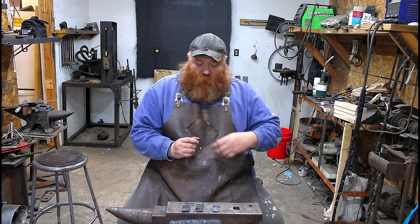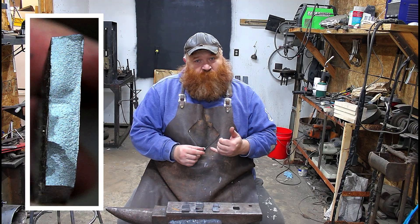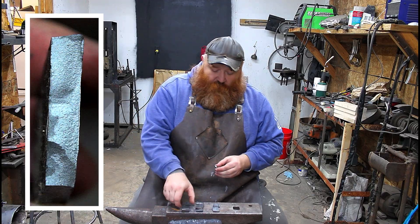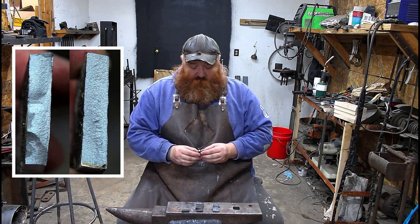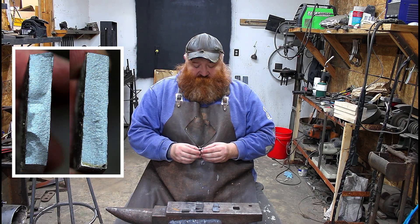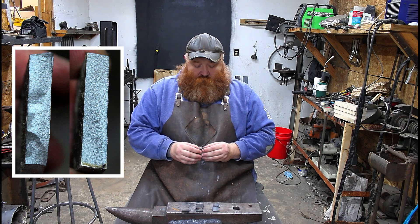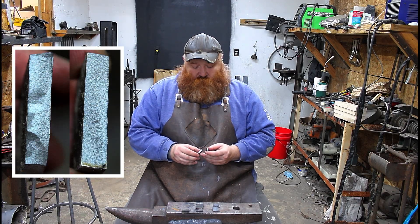Now, when we take a look at the oil pre, we got good grain structure. It's not super granulated, which means we didn't overheat it. We didn't overwork it. And pre-temper looked pretty good. Now, if we go take a look at post-temper, it still broke — one hit, not even swinging very hard. We were really hot, like really, really hot — we were over 1,600 degrees when we quenched it. And we have good grain structure, just like before. It did consolidate a little bit, align everything. The snap was a little bit smoother.